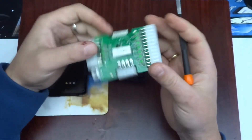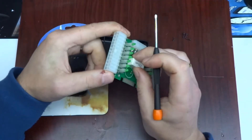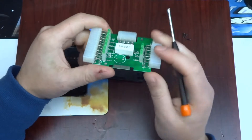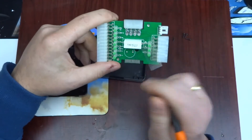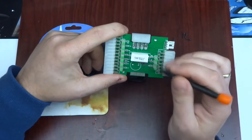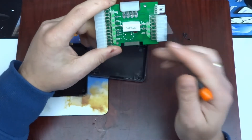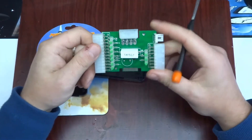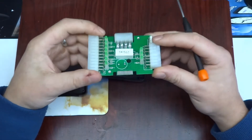There's a five-watt, 15-ohm resistor in the middle, and the purpose of that is to provide a little bit of load — probably on the five-volt rail — because power supplies do require a little bit of load before they start operating properly. So they've just put a resistor in here. What we've got is just a bunch of resistors and a bunch of LEDs on each rail. You'd think that connecting an LED with a resistor to a rail tells you whether the power is there — and that's fine — but it's not.